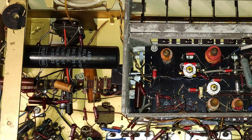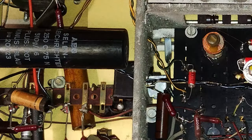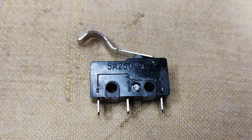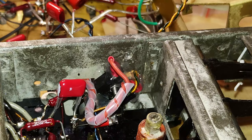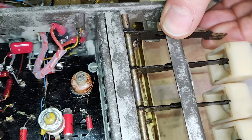Unfortunately, on many radios that were sharing this method, the power switch was located in a very inconvenient location, usually making the substitution unfeasible. The same happened to this unit that came with a broken switch, which could be replaced only by removing completely all the keyboard switch mechanism, with almost the certainty of damaging very delicate components. Also, the back of the switch body was not accessible. Therefore, it was not even possible to attempt to repair it in place. Usually, the alternative is to fit in a small micro switch, which is what has been done for this restoration. Here are different views of the working mechanism.